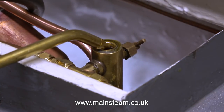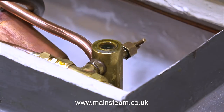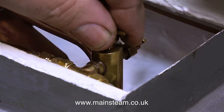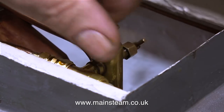I'm using steam oil for this job and I'm filling it right to the top. That way, when I put the cap back in, a bit of oil is already pushed into the steam line before the displacement lubricator even starts displacing. This particular type of lubricator has an oil control valve, and I would normally open this one full turn from fully closed.